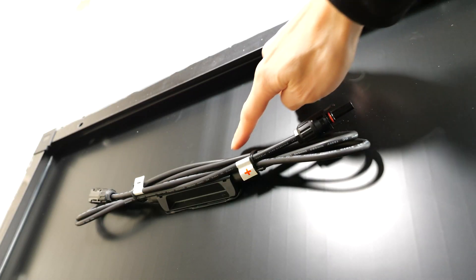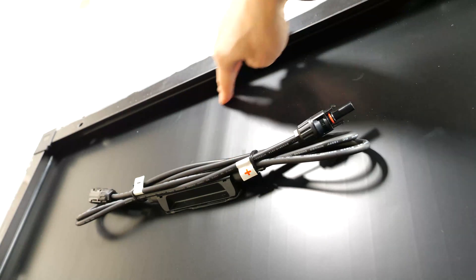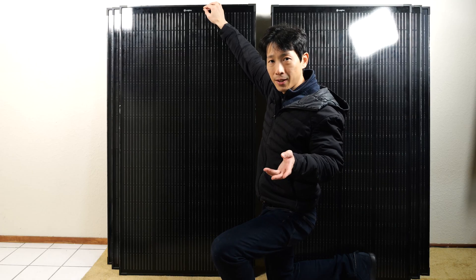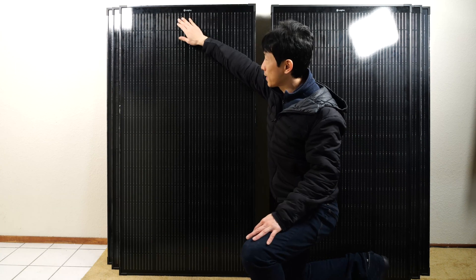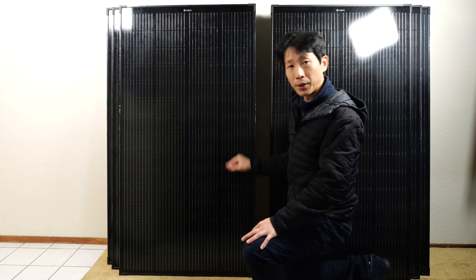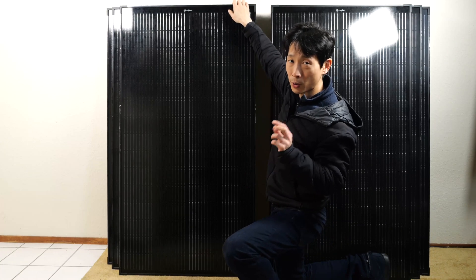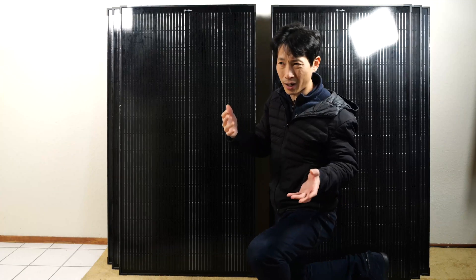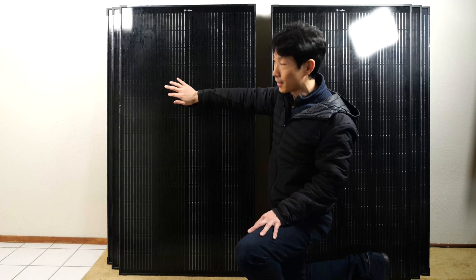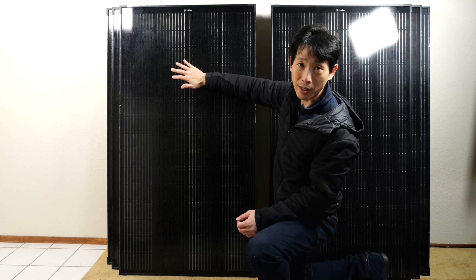If I move the light around, you can see two conductors coming from this box all the way up to the top bar. 30 half cells at around half a volt each means 15 volts. You've got a second string — 15 plus another 15, that's another 15 volts, but 6 amps each. So a total of 12 amps roughly. 12 times 15 is around 180 watts. But in reality the voltages will be a little bit higher, so in full sun you're going to get your 200 watts.